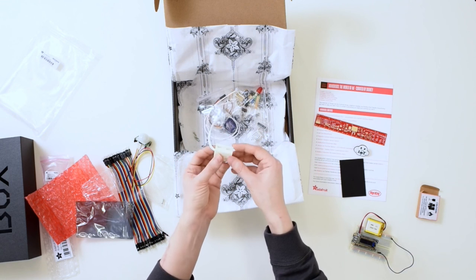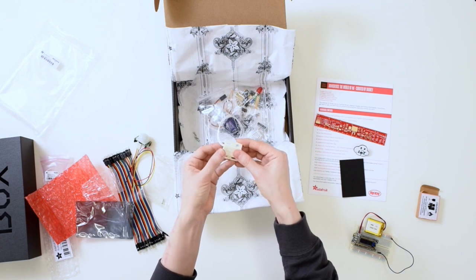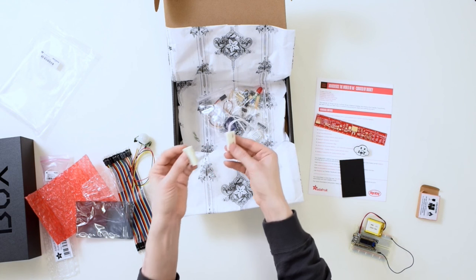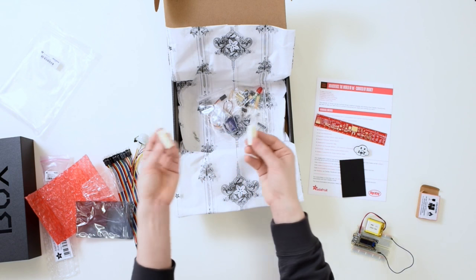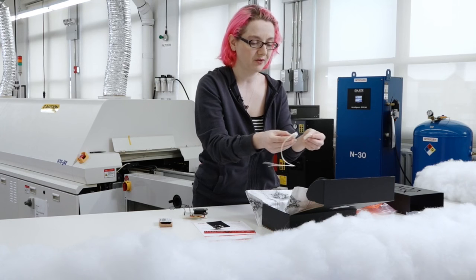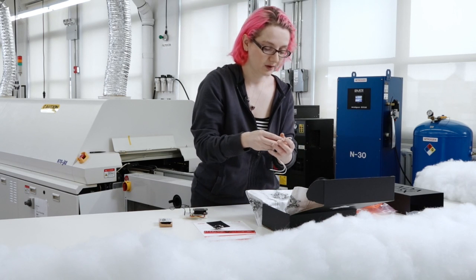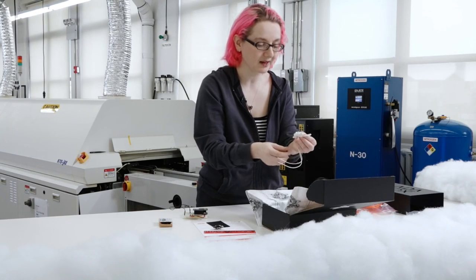Or you know, maybe you want to notice when somebody's opened a door. That's what these are often used for, or to open a window. So this will be able to tell you when something is pulled apart or opened. It's also kind of a nice generic sensor. You can use it for a whole bunch of things if you want to detect if something is close to something else. So we call it a door sensor, but it's really a magnetic sensor.